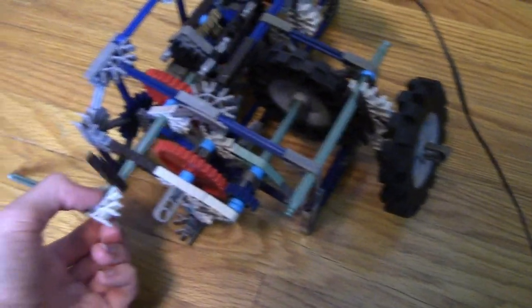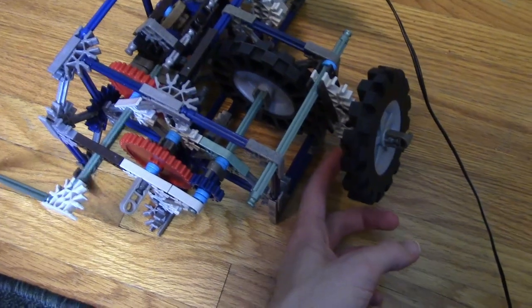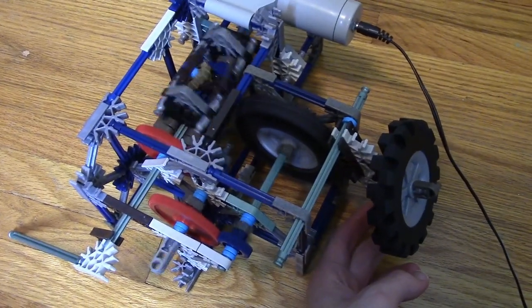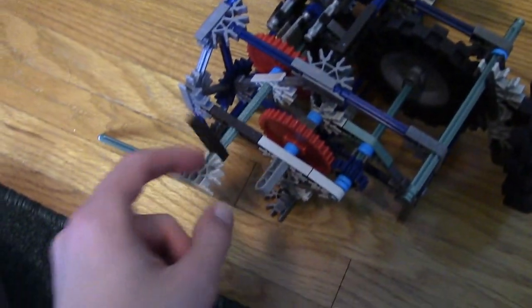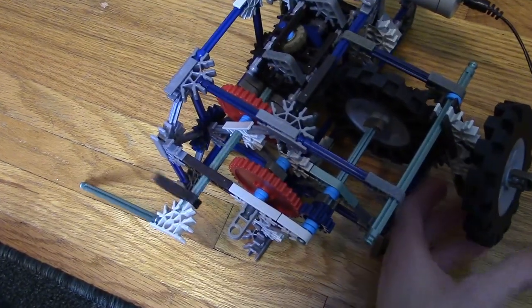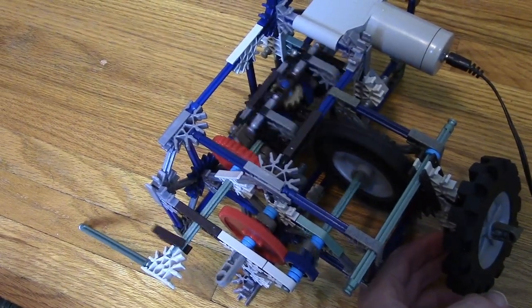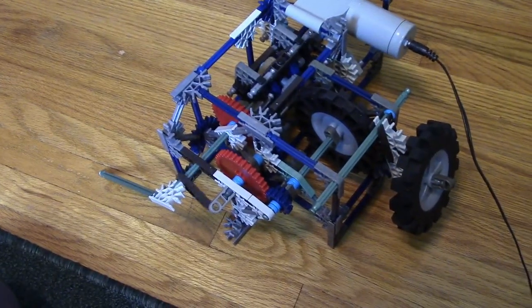Right now it's completely locked, and even if I apply a lot of torque here, it still stays there. So if you just release this a little bit, it starts to spin up like that. And then if I release the brake slowly, then it's a more gradual stop for the differential. And you can see on the output it will go slower slightly and then back up to regular speed. Now the brake is a lot more sudden than it is when the flywheel spins up, as you can probably tell. It's a very slight adjustment going down, but I think that'll be good enough for these purposes.